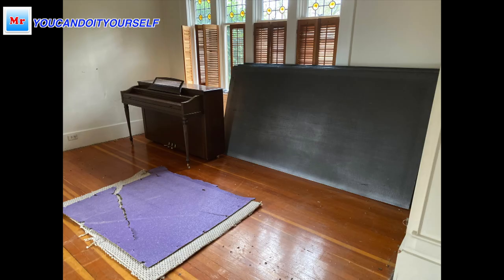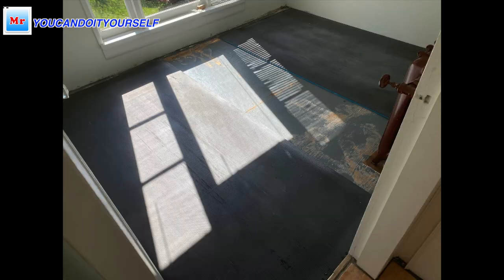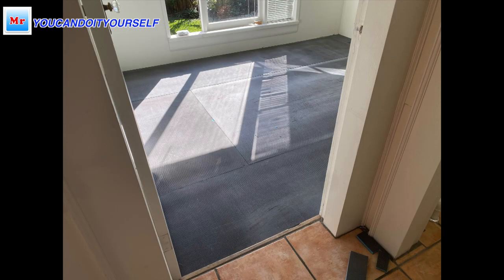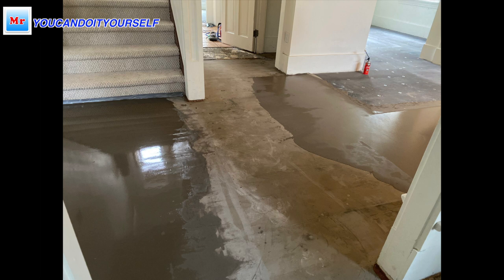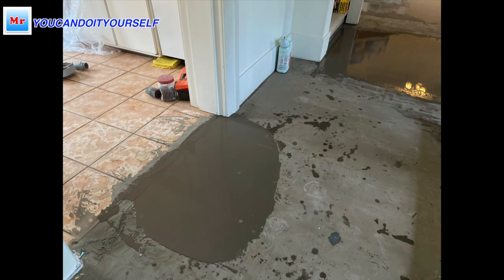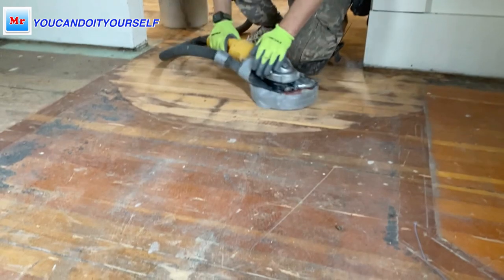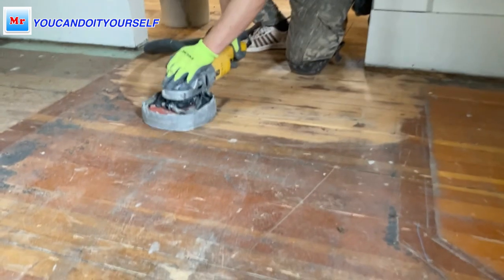Here is the garbage with the plywood and carpet already moved out. I've brought backer board which I'll install in this room after I remove the carpet. In this small den, like I said, it's one and a half inches down, so I put three layers of backer board to make it flat with the other floors. You can see I already put backer board on the right side, and with self-leveling compound I made a slight ramp.